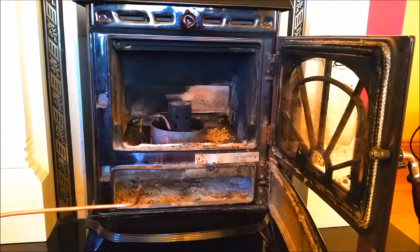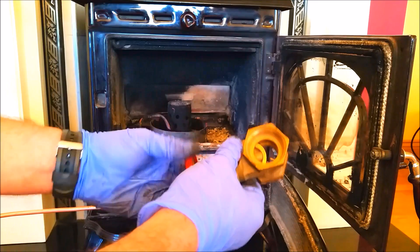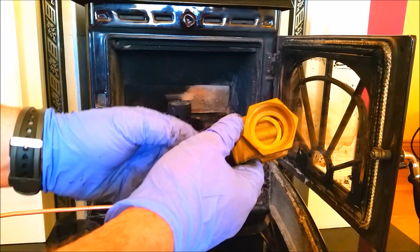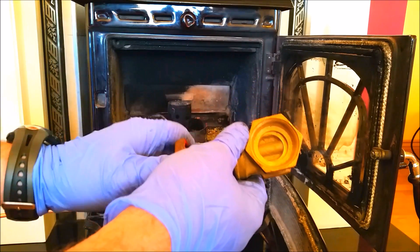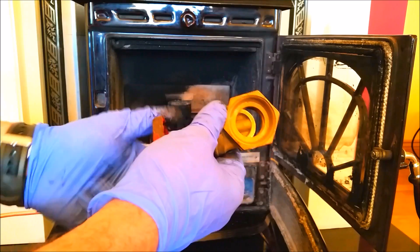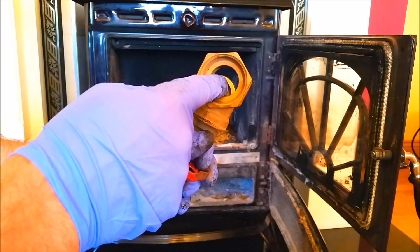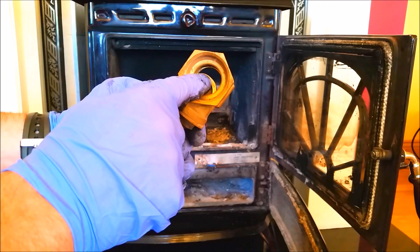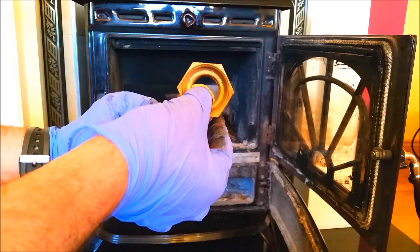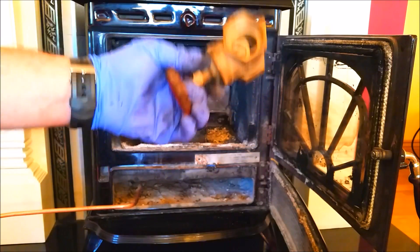I'm going to show you a couple of valves now on how they work. This is how a gate valve works - it's just a big gate valve I have, about an inch and a quarter. You would be using something half inch or smaller. It's just like pulling up a drawbridge and allowing the fluid through. Some of the guys recommended that I cut a V groove here on one side of it, and just a little notch on the far side, and it has proved really, really good. But if you go too deep with your groove on this side, your valve won't close off - you're actually creating a leak. But with that said, that's a gate valve.